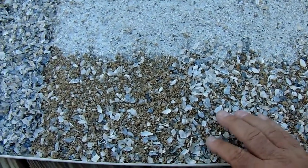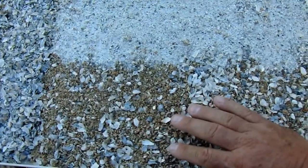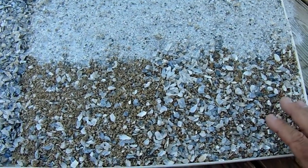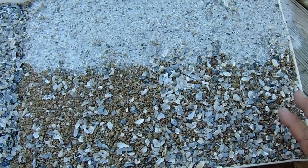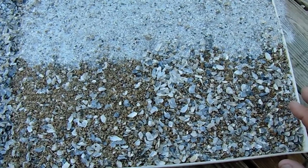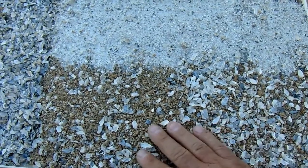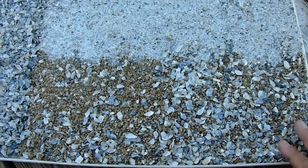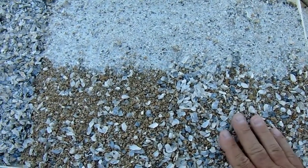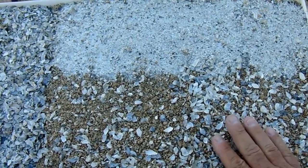After you've been using the court for a little bit, you need to refresh the surface, which is done by raking up the surface. If you have a pure clay or pure decomposed granite surface, you're going to have some strenuous labor bringing that stuff up, softening it, re-raking it, and leveling it out again. This blend allows much easier maintenance of the court. Also, it looks super trick — I've got to admit it looks pretty darn fancy. So that's a great talking point, but more than that it just provides a really good playing surface.